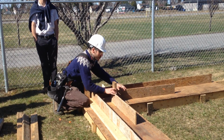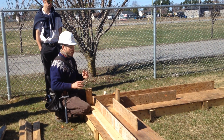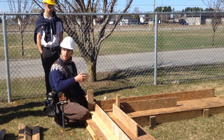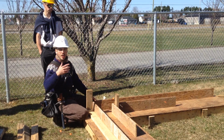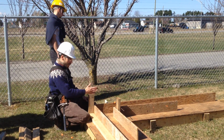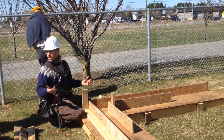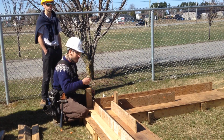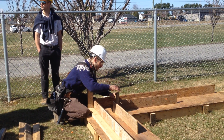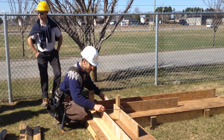Even with the studs, it's not going to be weak. It's never really weak because we're going to build it strong, right? But we have to decipher which one is the weak and the strong. It's just a rule of thumb. When you build and build, you'll just understand that you have a stud like this one goes like that, and the tie rod is close to it. We could just say this, but if we talk about strong and weak, it starts to give us more design logic. Okay? Or over here like that. And then I have another tie rod that goes somewhere over here like this.